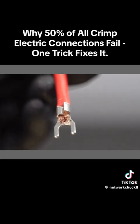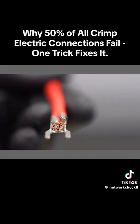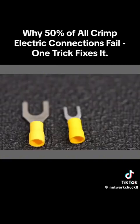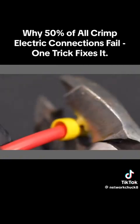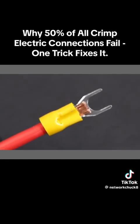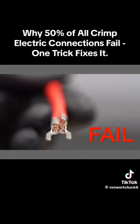I know you're thinking you could just put it back in the tool and crimp it again, but the problem in real life is even worse because many people use insulated connectors where you can't see what's going on underneath. When we do the exact same crimp with this tool on an insulated connector, the end result surprisingly looks pretty good — but when we peek underneath, you can see that it is just as poor as with the uninsulated terminal.